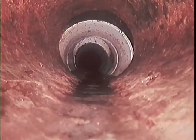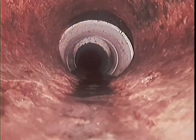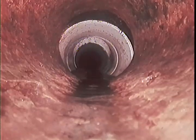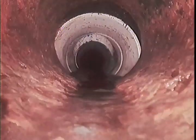Myself and Connor installed it. Myself and Archer came down here, ran some tests, checked the backwater valve. We found this line was actually blocked. Went ahead and sent my mainlining machine with both the grease cutting tip and the straight tip to see what we were looking at. Turned out it was all just toilet paper, stuff like that.